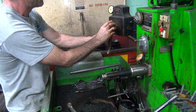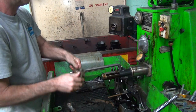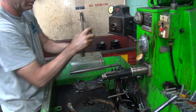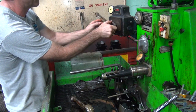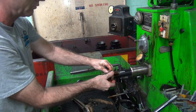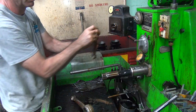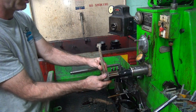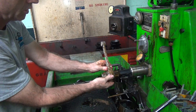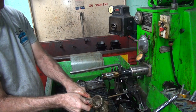Slowly do it on this side. There's two and a half to the plus side now — that'll equalize it. This rod, negative one and one and a half. Zero. Zero. It's within a tenth now all the way around. I'll haul these within a couple of tenths of final size and then switch over to a fine stone.